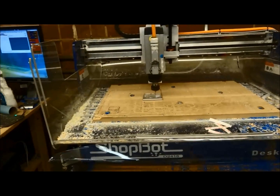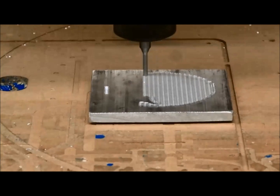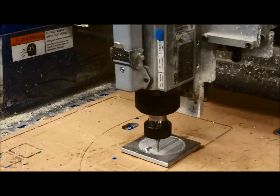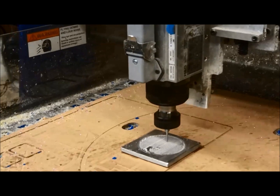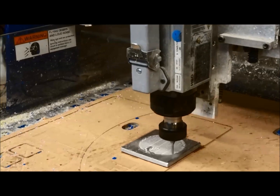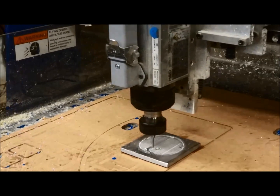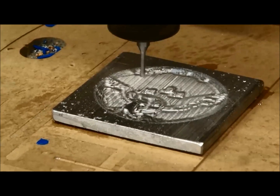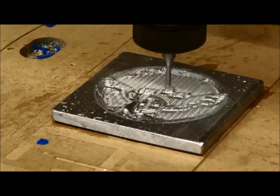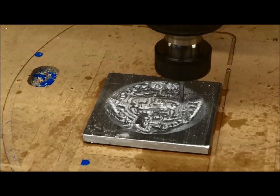Here's the 3D cut in action on the desktop. The aluminum is held down with VHB tape. The eighth-inch end mill is doing the roughing pass at only 0.01 inches deep per pass — ten thousandths. It goes around the 3D model leaving the higher spots as it normally would. You'll want a good dust collection system since you don't want aluminum chips getting mixed in with wood or embedded into the MDF spoil board, which can also warp if fluids soak in.